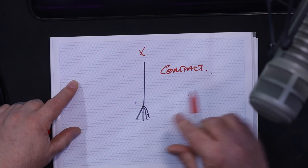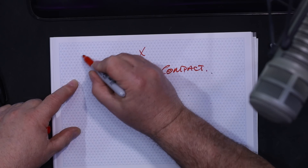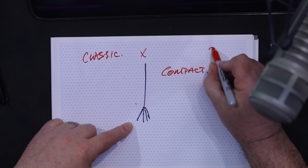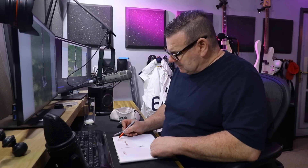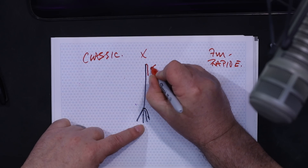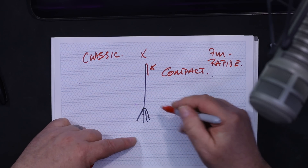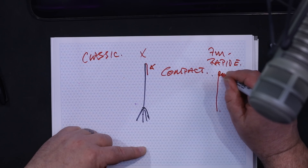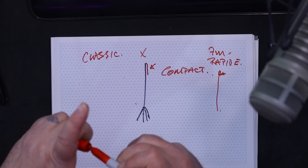Just to recap: the classic uses the 10 meter pole, the Expedition is roughly the same length, and the Rapid is based on a 7 meter pole — actually 6.8 or 6.6 meters. The overall length doesn't matter much because on the 40 meter element we linear-load the top, and we get 15 off that as well. On the Rapid, the 30 meter element comes up and we use a very slight fold-back at the top to get a perfect tune.